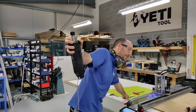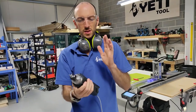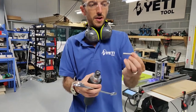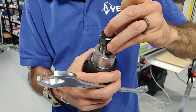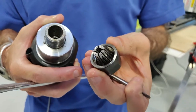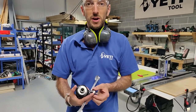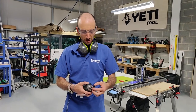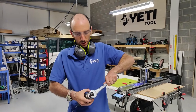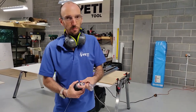So that's our 3mm ball nose cutter in. If you want to know the difference between the collets we supply with this machine — this is the pro version — the main difference is that you can very easily take blades out. It's got a captive collet which, the way it's been wire cut, means that as you apply torque to the nut it spreads the load very evenly across the shank of the tool. You get way better concentricity and it also makes the entire thing a lot easier to fit — tools never jam inside the collet. In my view it's completely worth the money because we change the tools a lot. But we do include the basic collet for the budget user. We could do a whole video on that, but next thing of course we need to put it back in the machine and zero it — same procedure as before.